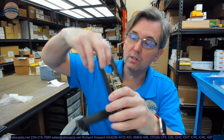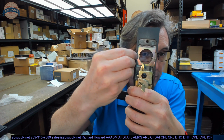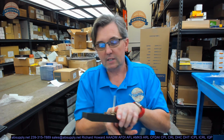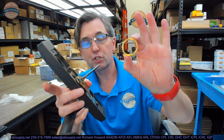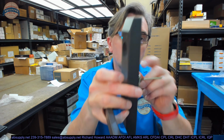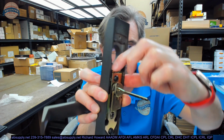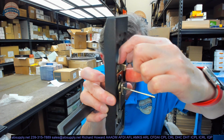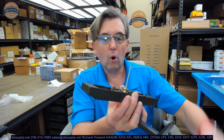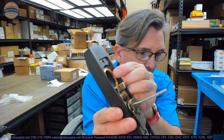And if you're familiar with mortise cylinders, you know that they have grooves on the side, and these little features at either end. The mortise cylinder will go through that. It's a bit of a hassle to get the cam ring or threaded cylinder nut in there. You'll notice at the tip of my finger, this locking lever has a little notch down here. In order to get that mortise cylinder in, you can only turn it when the threaded ring sits inside of that notch that's down there.